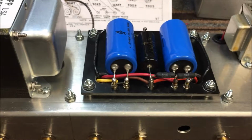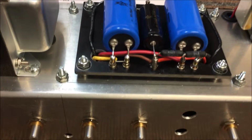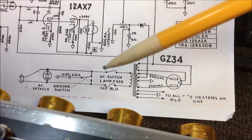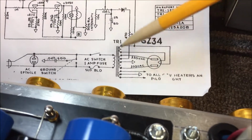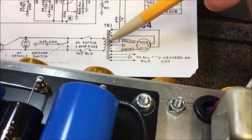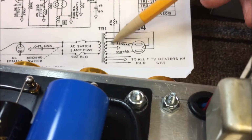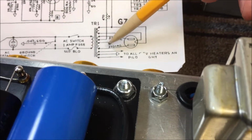So what I've got is I come in with my power cord. Go through the AC switch, which powers up the transformer itself. Once the power to the transformer is powered up, remember this is AC in, AC out, just like I talked about in the last one. So this is my secondary, this is my primary, this is 120 volts. This side's got my individual coils.